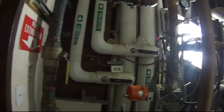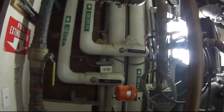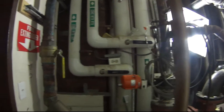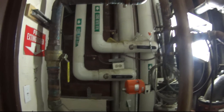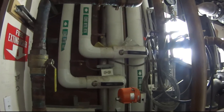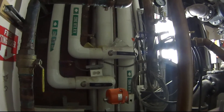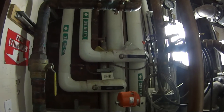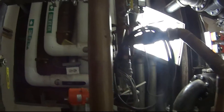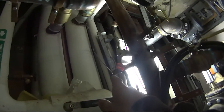We need to maintain 80–85 degree water temperature. When it's running in heat pump mode, the condenser tube-in-tube becomes the evaporator. Now when it's running backwards, the system water loop gets cold, and we need something to keep that temperature up — and the way that's done is with the boiler. Basically we have a supply and return.